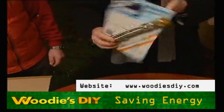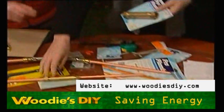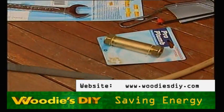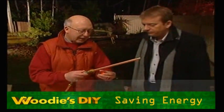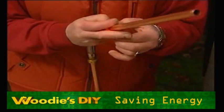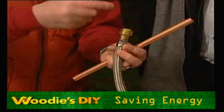And they have them in different sizes — so that one would be €14.93, that's three quarters, and you have the larger ones here as well. You got an absolute mad rush on it. If you ever want to take this apart, you can take it apart with that little tool there — push it onto the pipe, force that back, and pull it out. The pipe comes out — there are little teeth in there that grip inside, that's what it is.